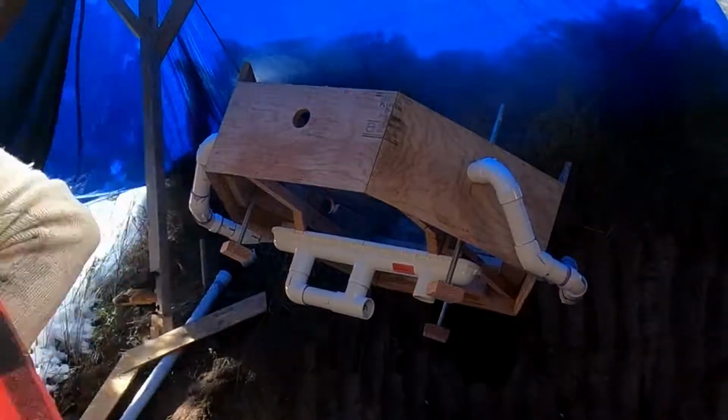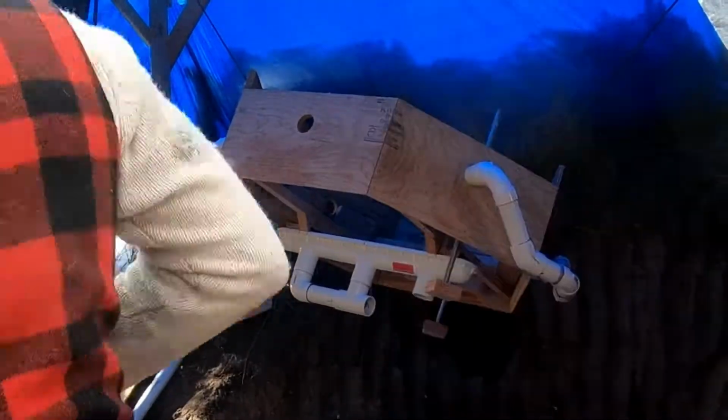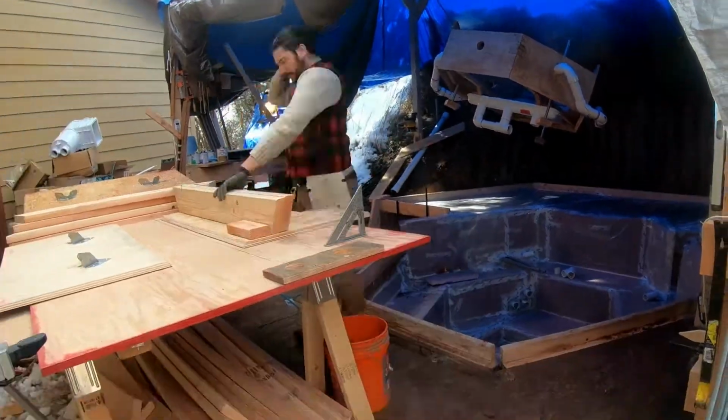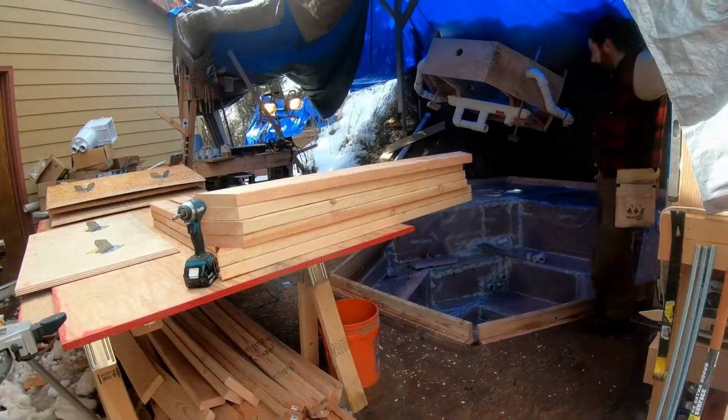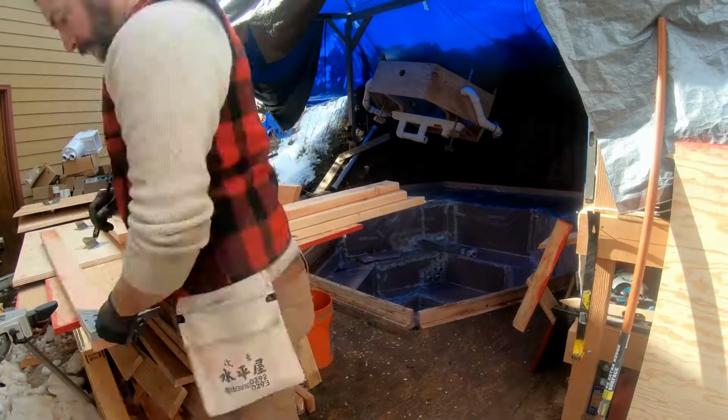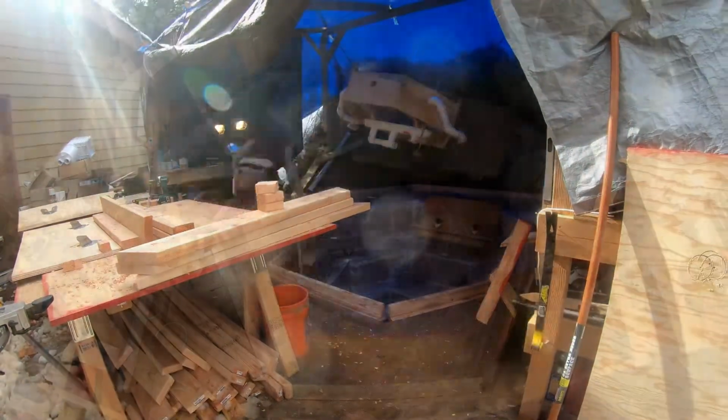There you see the wooden supports holding the drain in place and the adjustable threaded rods that I used to level the formwork in the hole. Next, I could prepare the supports for the upper wall forms. Since each of these had 2 jet tubes, I added metal angle brackets outside the holes to support them.